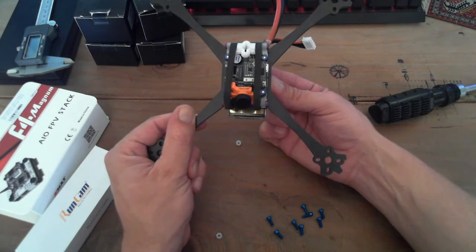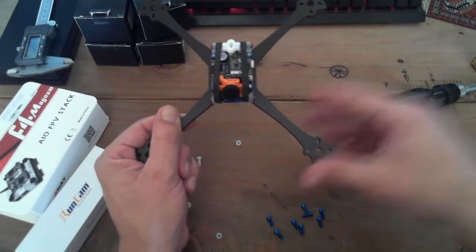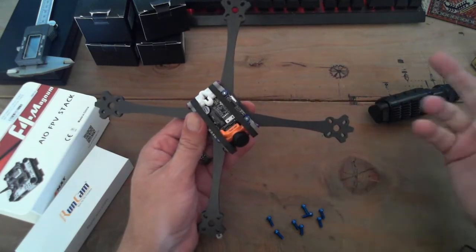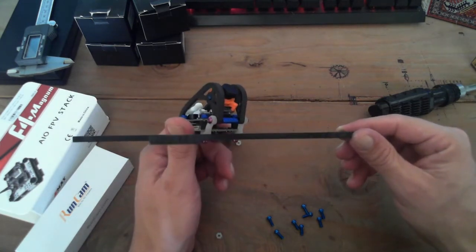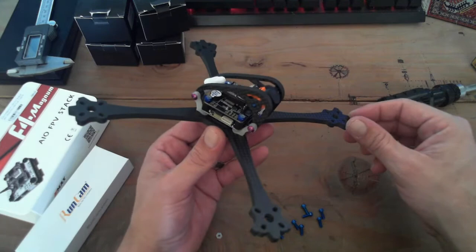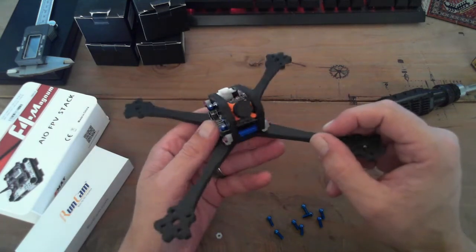So even though you're not aerodynamic and you're sort of air cooling that frame, you're not going to get a ton of extra drag. And in relation to that, the arms themselves are basically the thinnest where the most amount of drag is produced by the prop. That's why this thing is going to be 6 millimeters thick, to basically square this up. Eventually we will chamfer it if we can get that service for not too much cost. And it'll basically almost be like a round arm that's super thick. We'll see how this thing handles crashes, but that's pretty much the gist of this.